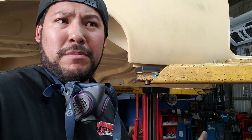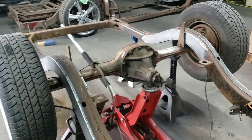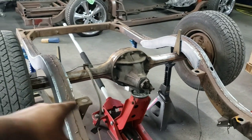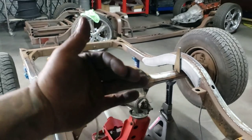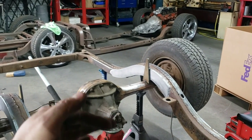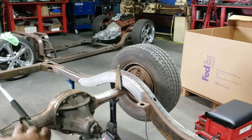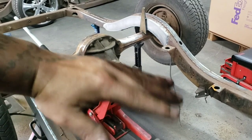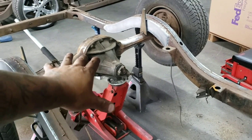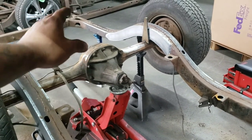Yeah, I guess that's pretty much it. So I got the rear end centered up now. Took me a minute, but I was able to get it centered up, jacked up, pinion angle correct. I actually went positive just slightly, because as this car locks up, the pinion's going to want to start pointing down because the arms on top are going to be slightly shorter. So I compensated by kicking it up just a hair because I fully laid.